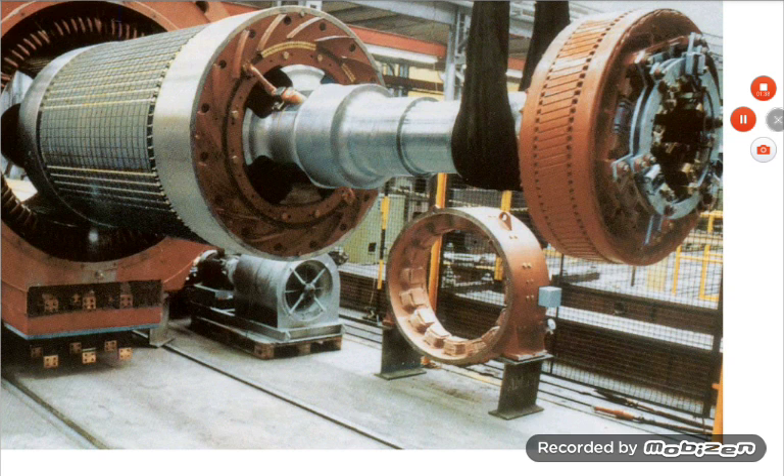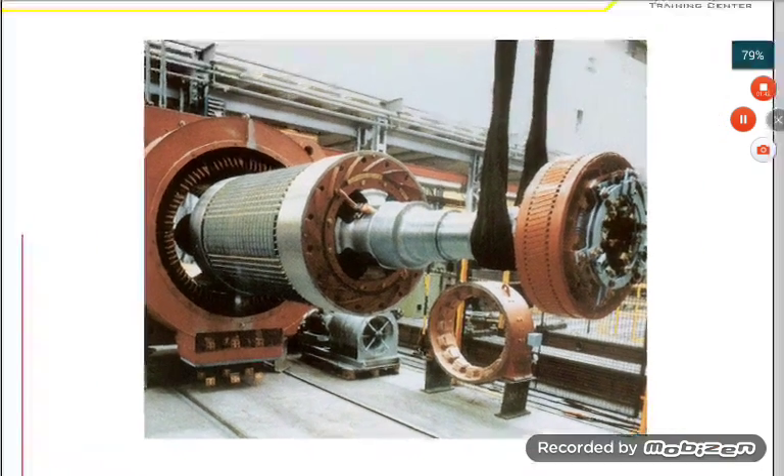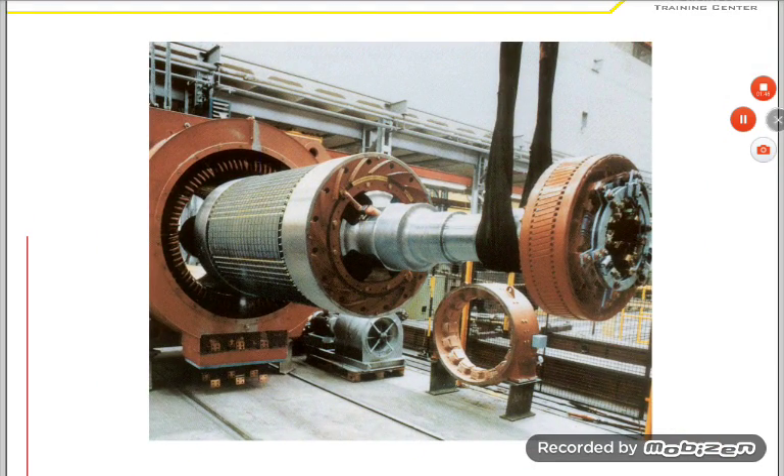I have some pictures of your slip rings and brushes here. Here you can see the rotor shaft. Here are two slip rings — these big, sized metal blocks. You need two slip rings, of course, because you have a plus and a minus pole with direct current. So you need one slip ring for the plus and one for the minus pole. And then the direct current is going inside of the rotor to the line.